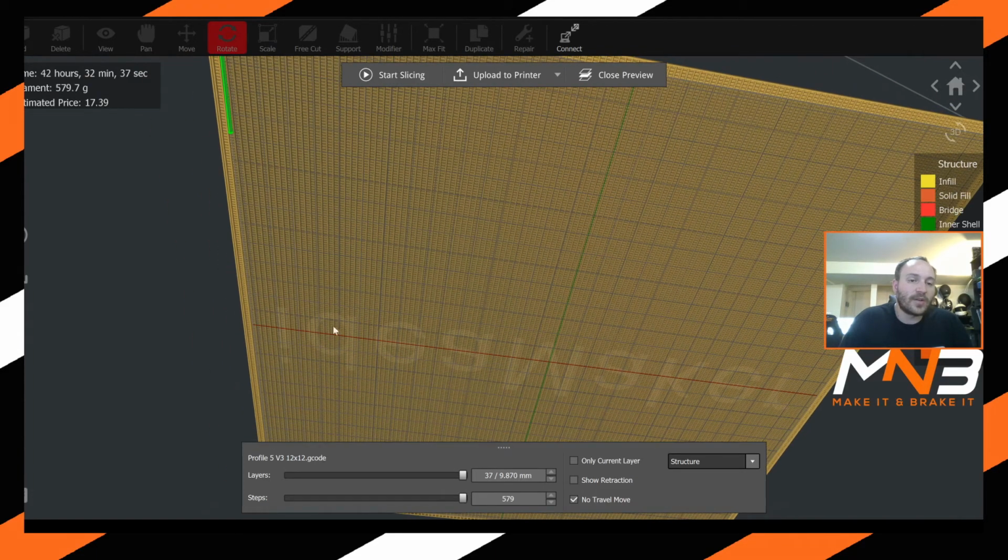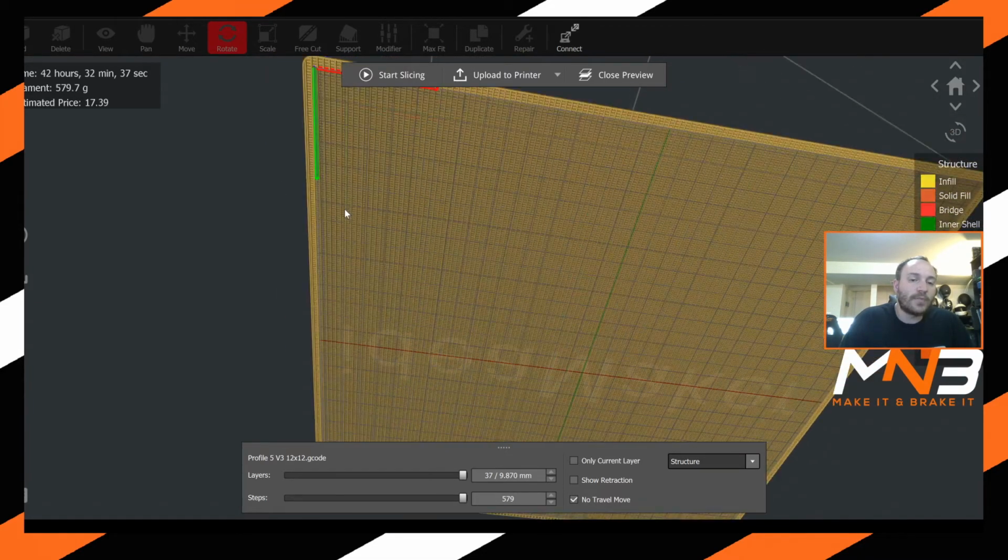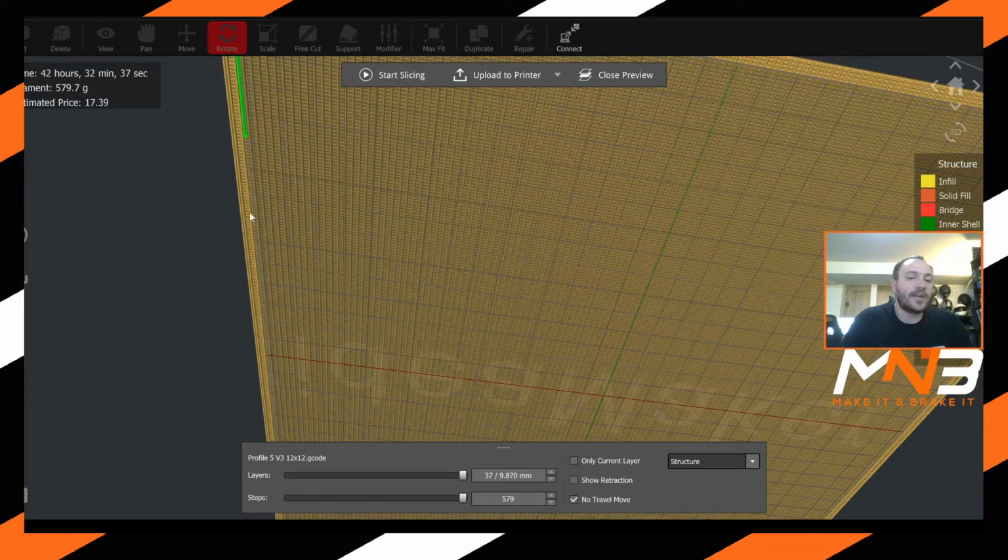that you can see over here. We have 3 layers outside of the build volume here, and it would try and print all 3 of these layers at the very edge of the build volume. What that does is that causes a lot of lifting, causes a lot of deformation, and essentially the base layer won't hold at that point, and it'll start deforming. Bad stuff happens and ruins your part.